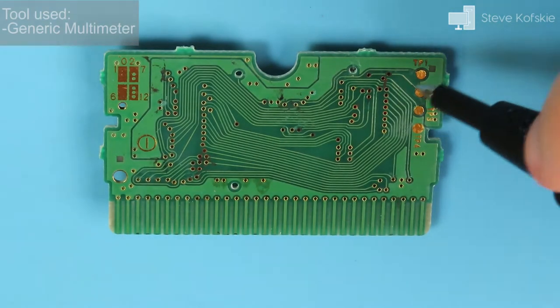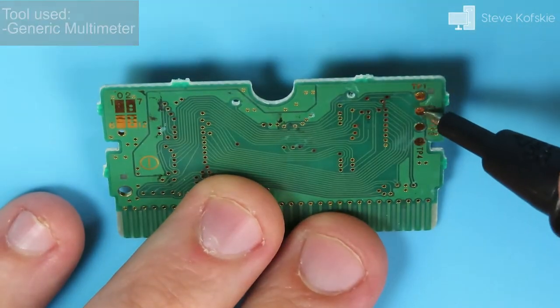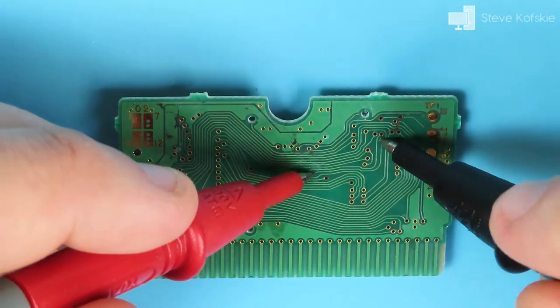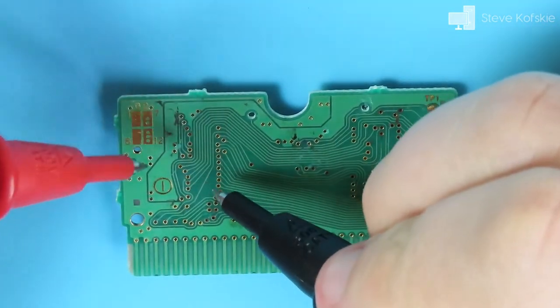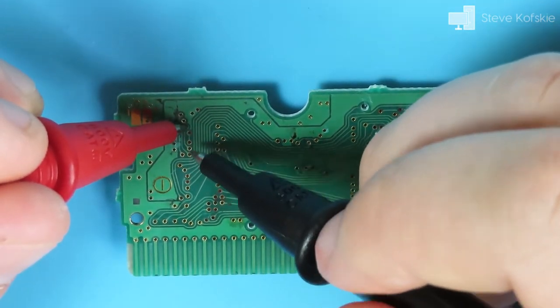Since I had my work cut out for me, the least I could do was take my multimeter, place it in continuity mode, and check every trace on the back of the board. This was a time-consuming process because it was basically a small connect-the-dots game. To help keep track of what I was doing, I took a photo of the back of the PCB and drew on top of the traces with a paint program to mark the faulty traces.